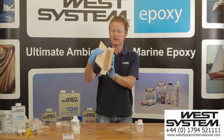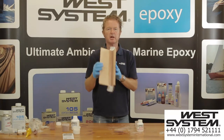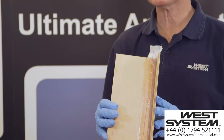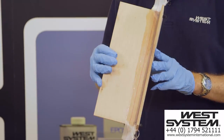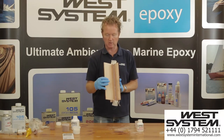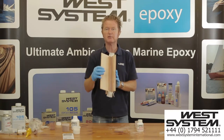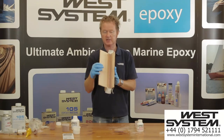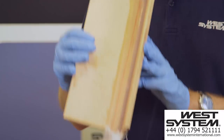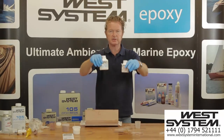And there we have a fillet where the surface has been primed beforehand, so we're using two-step bonding to create our fillet. We've then glassed over our fillet with 50mm wide glass tape, and then we've peel-plied that. You could not achieve better results than this method. Very, very strong, very, very effective, and look how much material we've got left within our mini pack.